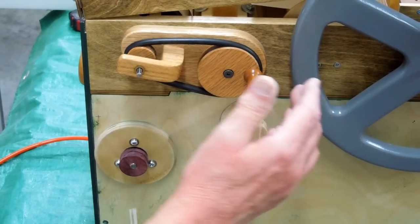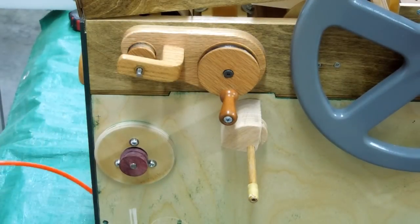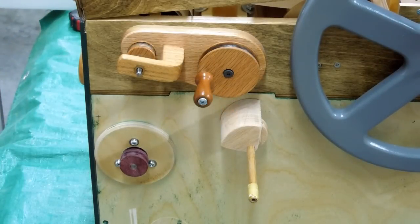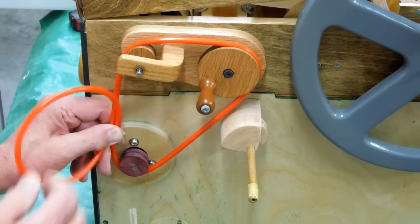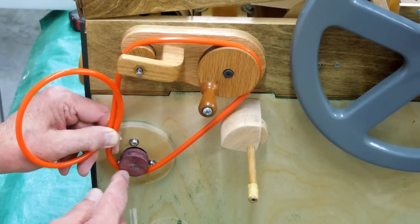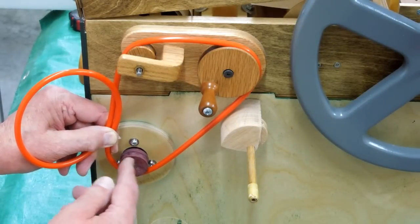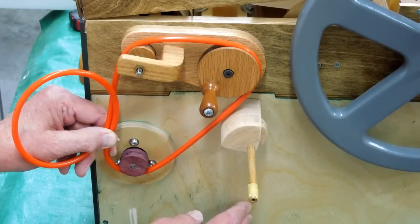Having said I don't like hand cranking that much, I also don't like rewinding that much. So the next objective — and one reason for getting the alignment the way I have it — with another belt made to fit on here, I can now rewind the music roll. There is a slight problem: this motor turns clockwise to drive the organ, but it needs to turn counter-clockwise to rewind the music roll. There will be a forward/reverse switch and a speed control.